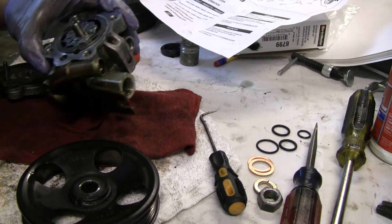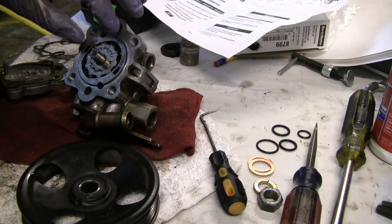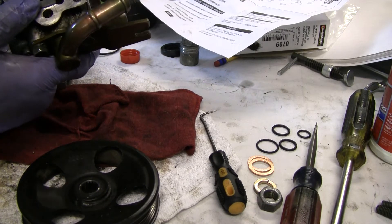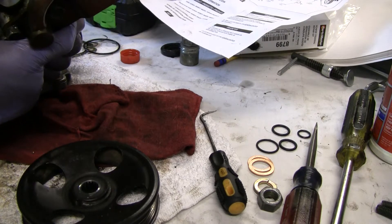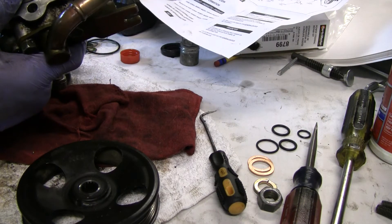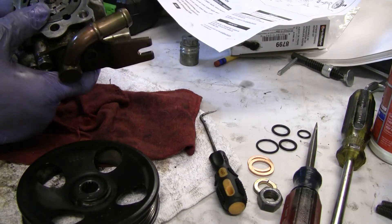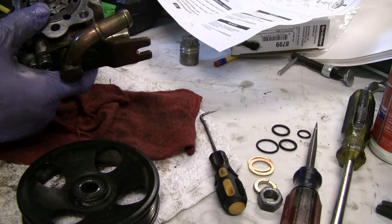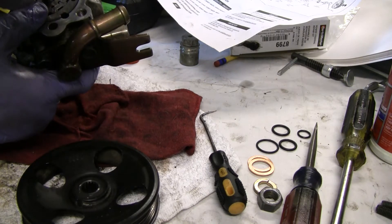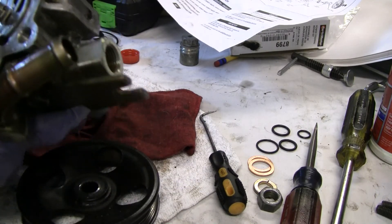I want to keep progressing because I'm really close to getting this thing finished. I just got this inner portion — the oil pump portion — back in. Then, after pressing the shaft back in and pressing the seal back in, this got a lot more tough. I think that's because the seal was pretty grody, number one. And this spring gasket type thing was kind of bent. I could have actually done that trying to remove it, but I'm thinking that after replacing that, the way it's running right now seems like it's going to be a lot better.